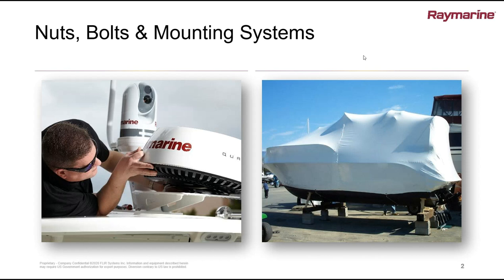We also need to look at the physical security of things. Who knows what high winds or large birds may have done sitting on the shrink wrap over the winter. Are all the bolts secured tight? Have any of them strained or caused damage? We need to look at the physical security of equipment still bolted on board. The last thing we want is fastenings to become loose or broken — once the boat gets in the sea, we could lose equipment over the side. Also check your radome enclosures and open array antennas to make sure none have been damaged.